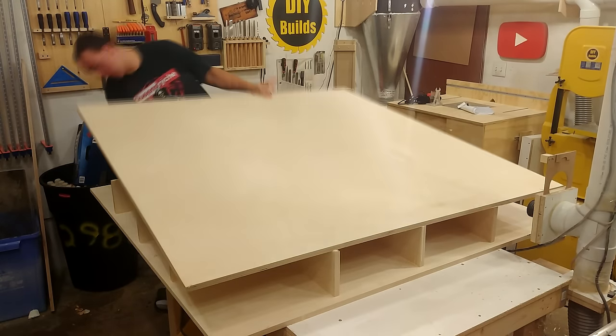I then bent up and drilled a hole in a scrap piece of aluminum and mounted my e-stop push button. I then taped together all the cables that needed to go up to the gantry and started fishing them through the upper drag chain. I then took a scrap piece of pine and started drilling some holes through it — this will be ripped down and used as clamps to hold all my cables in place.